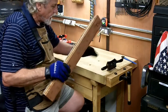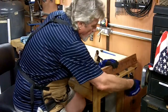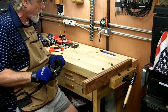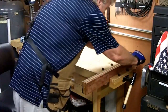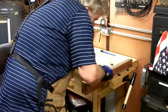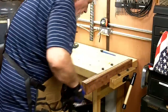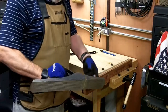There are some big globs of glue on here, so before I use my foreplane I'm going to take this old Stanley number 80 — it's a card scraper, basically a cabinet scraper, but it's got handles. When you have bad hands, this is the way to do it. I'm just going to take all this glue off so it doesn't damage the iron on my foreplane, the number 6. Let's get the old 6 and see how it goes.